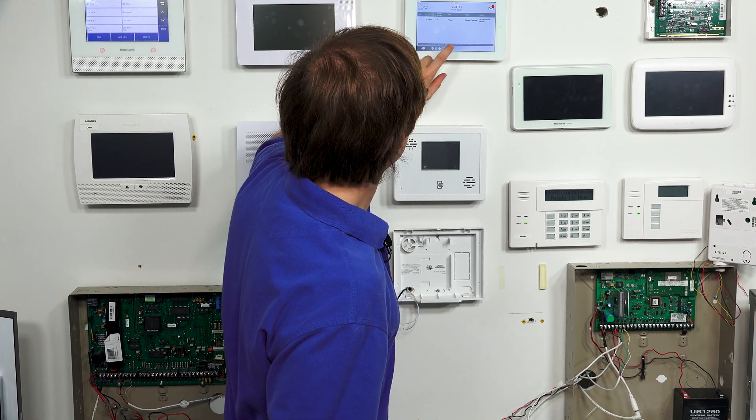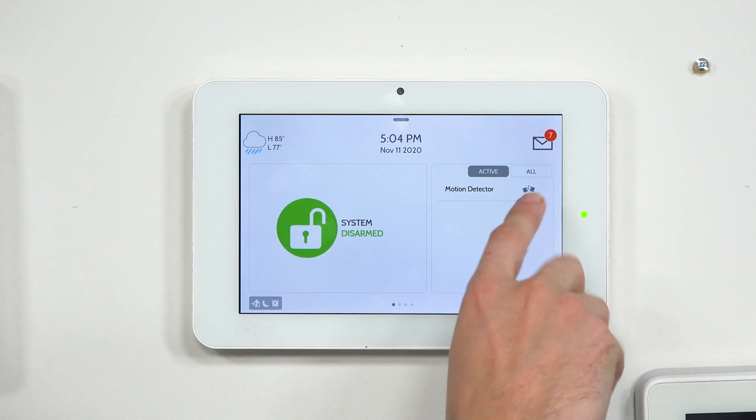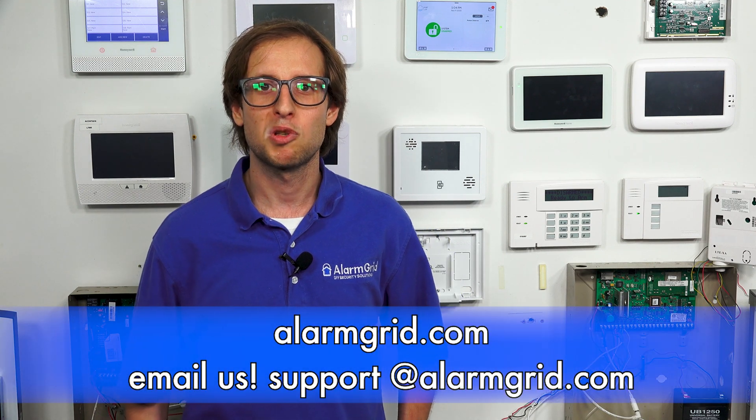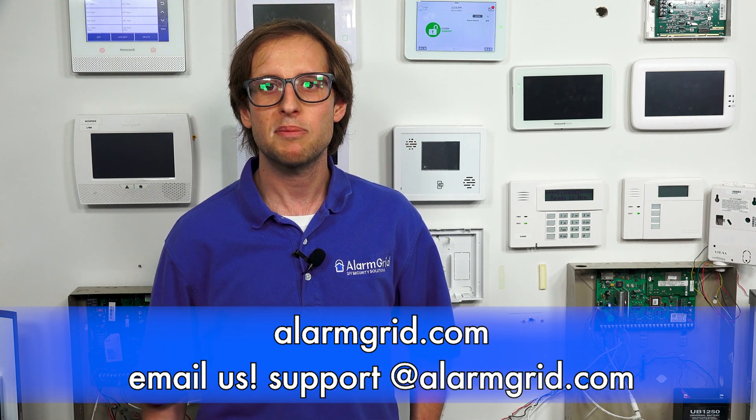We'll press the home screen. Now we know our motion sensor will trigger an alarm if active when the system is arm stay or arm away. The tamper signal showing is because the sensor was never closed. So that's the alternative to arm night on the Qolsys IQ Panel 2 Plus — sensor groups 15 and 35. Sensor groups 17 and 20 are the non-arm-night motion sensor zones. If you have questions about sensor groups or alarm monitoring services, send an email to support@alarmgrid.com. If you found this video helpful, give it a thumbs up and subscribe for updates on future videos.